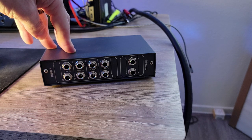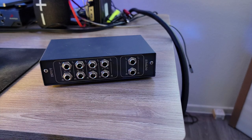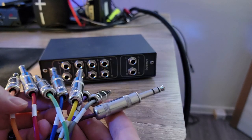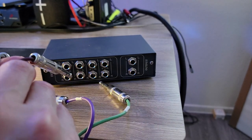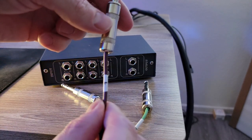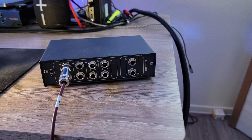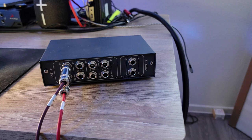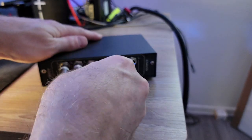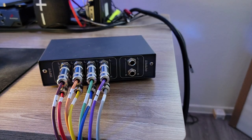Sometimes DB25 connections would be best — you could have two of those for 16 channels of mono, but this one has eight. The TRS cables are balanced — you can see the two rings and the tip — and balanced connectors are better for distance. I'll connect cable labeled one straight into input labeled one, then follow the same order through. You'd probably want to put two in before one so you don't have to fiddle around at the back, but I'll follow the sequence up to eight connections.